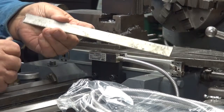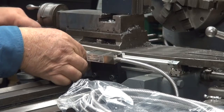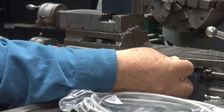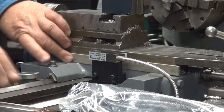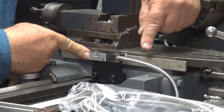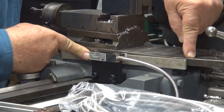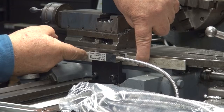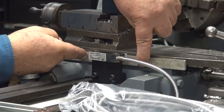The aluminum plate is going to increase my thickness by better than an eighth of an inch, but that's the way it's got to be. My next step is to mount this aluminum plate onto the cross slide. That's going to give me an extension back over this end — which is already an inch into the taper — but it's going to be straight out and I'll be able to mount the scale out there. So my next project is to mount this aluminum plate in the proper location and then mount the scale.